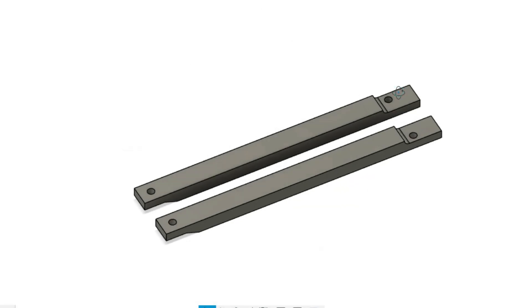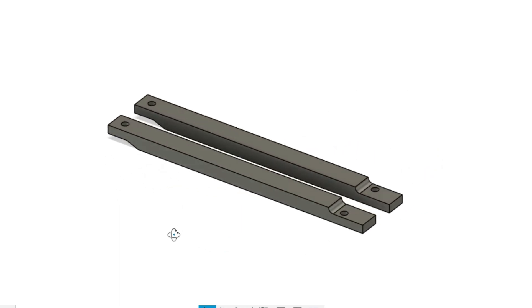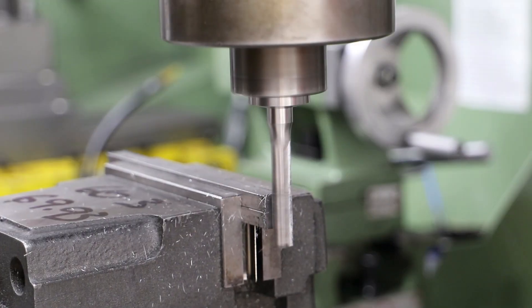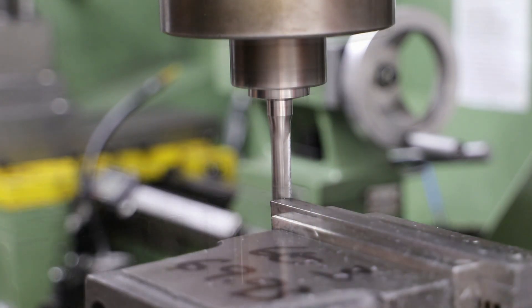Making the slide bars is going to be relatively easy. I'm sure in days of old, before cheap machine tools, these would have been done by hand with a hacksaw and some files. There are two pairs that need to be made, and the only thing to note is that each pair will be handed — that is, this hole needs to go on one side for one bar and on the other side for the other bar. Luckily I've already got some quarter by three-eighths stock.